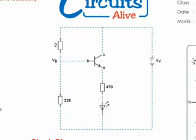In this video I'm going to show you how a light sensor circuit works. This symbol here is a bipolar junction transistor, otherwise known as a BJT. The B represents the base, this is the emitter, and the collector. When the base voltage is greater than or equal to 0.7 volts, the transistor will be turned on, allowing current to flow through the collector to the emitter.